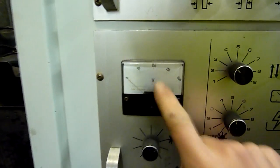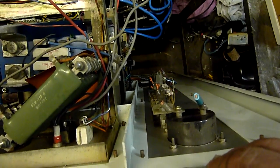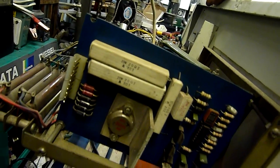This machine has done a lot of work. There's a volt gauge up to 200 volts - not quite practical for 240 volt jobs - and an ammeter inline, straight up to 30 amps, no current transformer needed for that one. For the most part most of this stuff is trash. I'll keep some of the high wattage resistors, but we had problems with some of those transistors being faulty and the control in there was faulty. There are just too many problems with it.